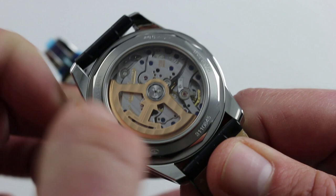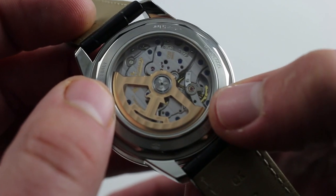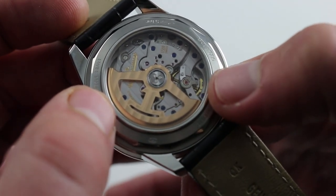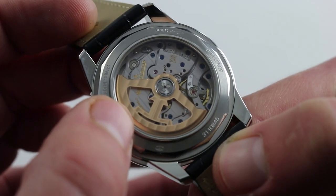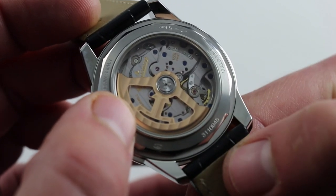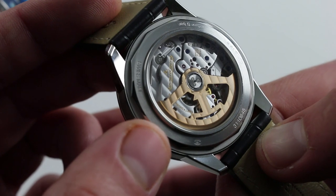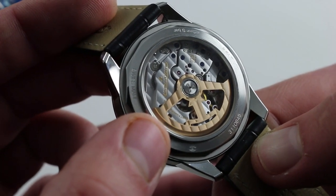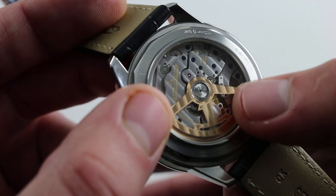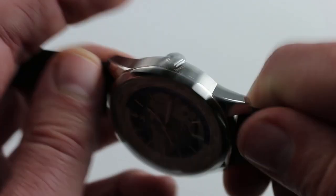When you pull the crown, it hacks — but not only does it hack, you can also see that the balance is discontinuous. It's shaped like a yoke, not a circle, and each side of the yoke is an interlocking, horizontally opposed J and L logo. This is to the aerodynamic benefit of the balance, developed originally in the Master Compressor Extreme Lab of 2007. We call this particular balance the Gyro Lab Balance. Everything else about the movement is classic Jaeger-LeCoultre: handsome perlage finishing, real heat-oxidized fired blue screws, gorgeous Côtes de Genève across all surfaces. There is a beautiful drawn pattern across the edges of the bridge — not polished anglage, but a neat drawing to remove any burrs and signs of original manufacture. It's handsome, it's high-tech, and it packs a 40-hour power reserve, beating at 4 hertz.